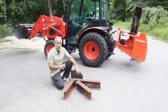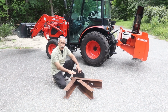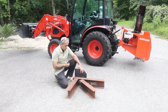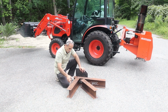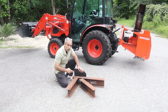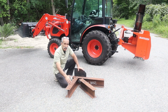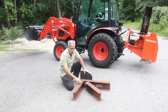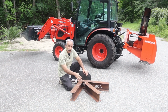One of the things you have to consider when you design a gusset plate is to make it really look nice, because in this situation our gusset plate is going to be seen by the public and have some architecture in it. What you have to do is try to line up with this edge and this edge, and then make a nice trim over here. How big and how wide your gusset plate is going to be is determined by the internal forces in these three members, and what it takes to make the shear connection. Remember, this is a truss, and our gusset plate is going to be a pin connection or shear connection.